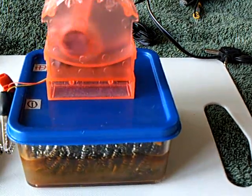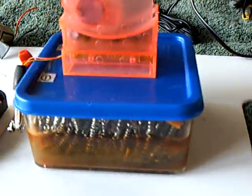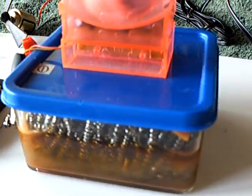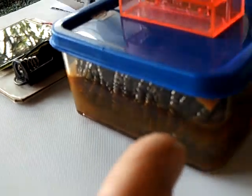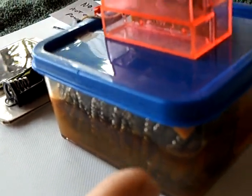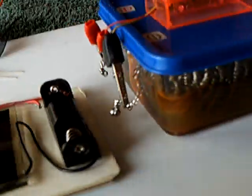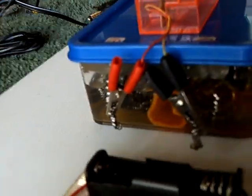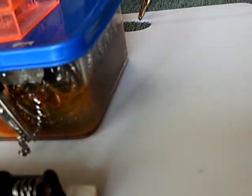I've been doing research to find out why this is working. The closest thing I've come up with is what's called an iron-air battery. You can see the rust color in the electrolyte solution. This is the anode — the negative part of the cell. And there's the cathode on that side, and the cathode is not discoloring. The solution on the cathode side is not discoloring like the anode side.